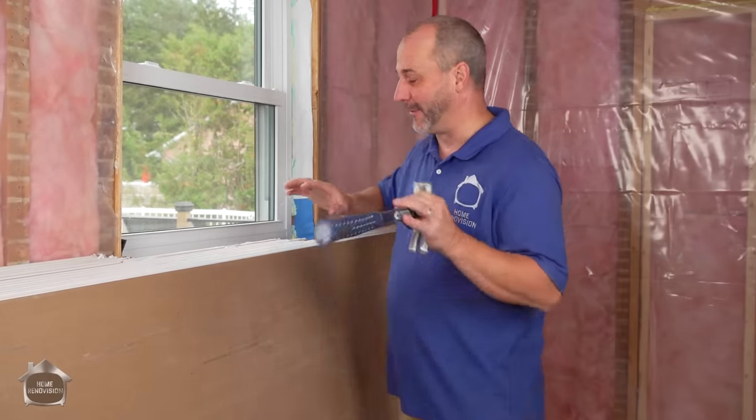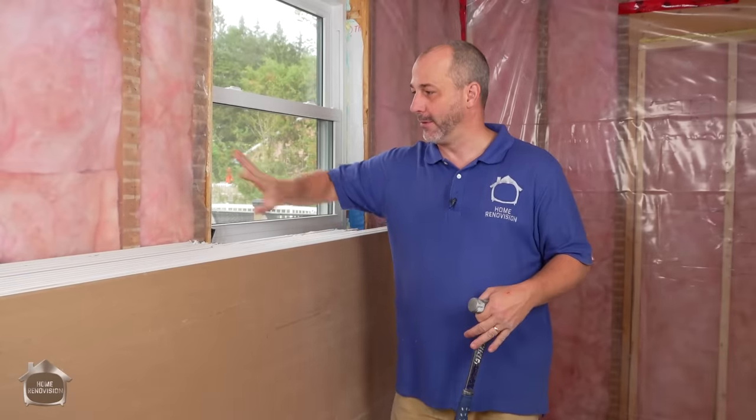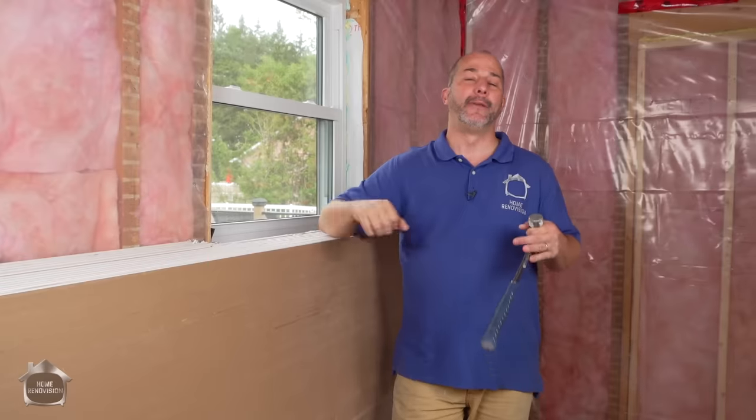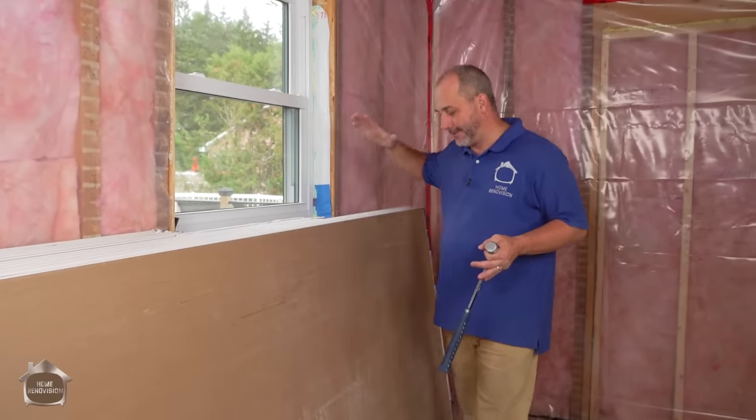It's worth a look. But anyway, let's get back to this. I like to bring my drywall into the room and put all the short ones on the wall first, because the shorter the drywall, the less important it is to my installation, and usually gets installed last. So I put my 8s first, then my 10s, then my 12s.